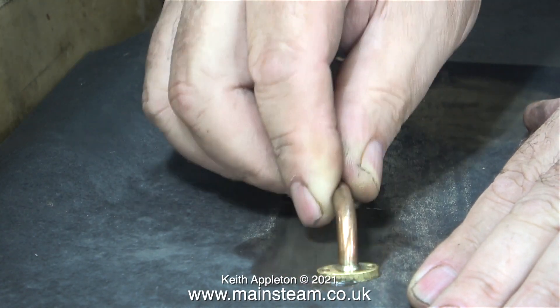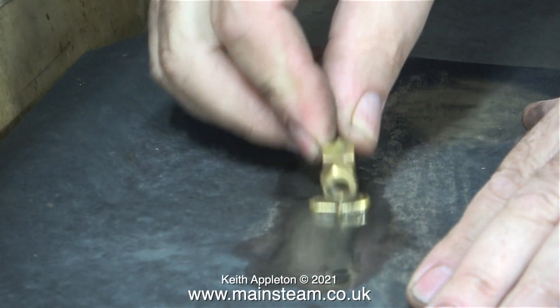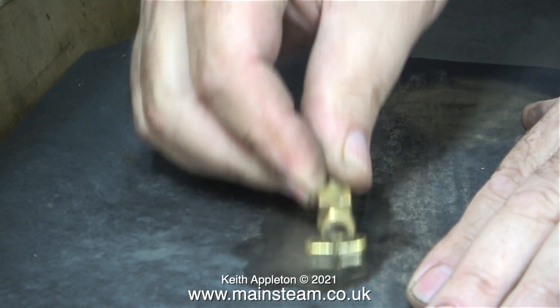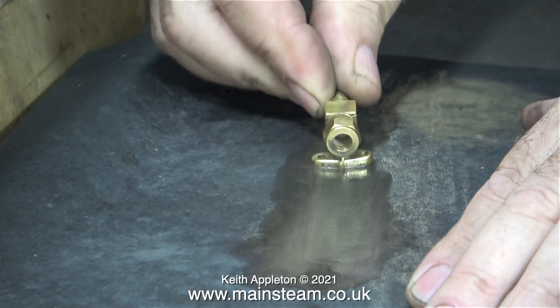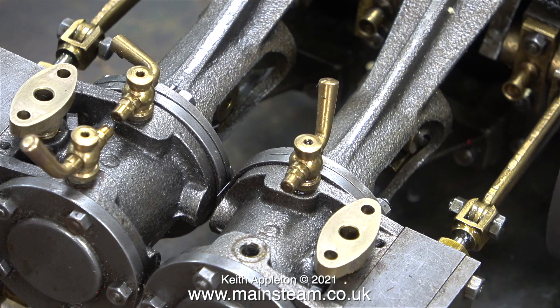A lot of the parts are not finished very well. For instance, the surfaces of the flanges on the exhaust and inlet pipes needed cleaning up using emery cloth first, followed by wet-to-dry sandpaper, and now they look a good bit better. Leveling off the flanges is very important because the gaskets will not be sufficient to seal the joints, and you won't notice any leaks until you steam the engine.